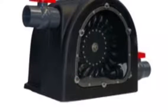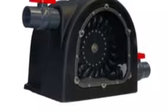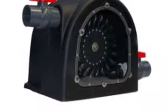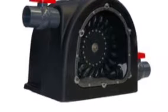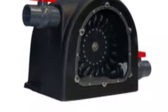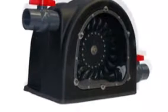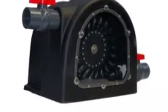We're back now to the original picture of the pump. Just wanted to give you some more specifications of what this pump is capable of. It has a 1 to 70 lift ratio, so 1 foot of fall you can generate 70 foot of lift. The maximum lift of this pump is 656 feet, and the pump weighs a total of about 45 pounds. For all the other specifications, you need to contact me, and we'll go back and take a picture of this stream right now and show you what happened.